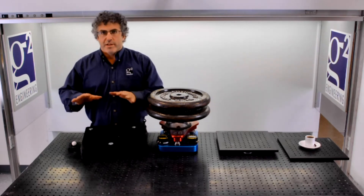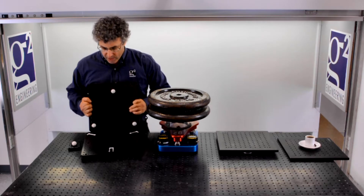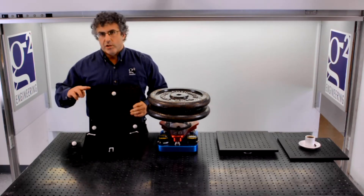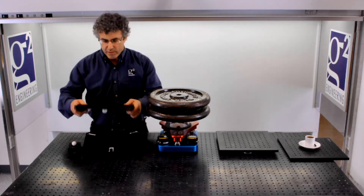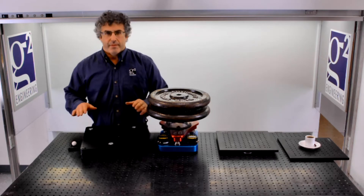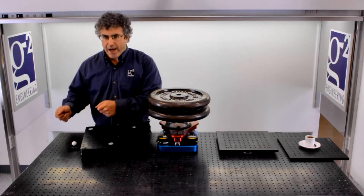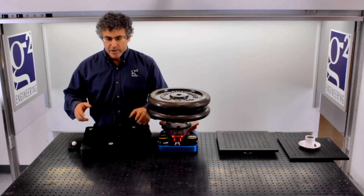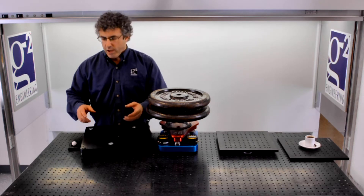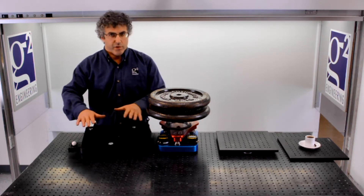To see how we do this, the best starting point is the traditional three-groove kinematic mount, which has three mating elements, each constraining two degrees of freedom for a total of six degrees of freedom and a full kinematic constraint. These mounts are very useful because they provide highly repeatable assembly and guarantee there's no mechanical stress caused in any of the components due to assembly tolerances, temperature changes, or CTE deformations.